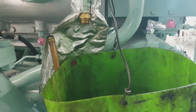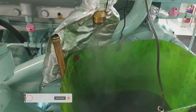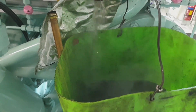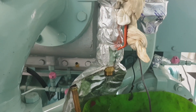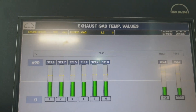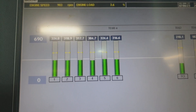As you can see, I am repeating the sequence — this is the second time I open the water supply. I continue until the drain water coming out becomes light gray. Once the temperature of the turbocharger drops below 100 degrees, close the water supply.